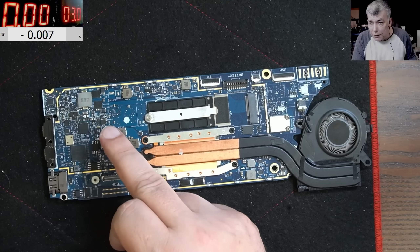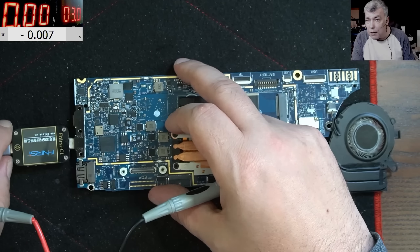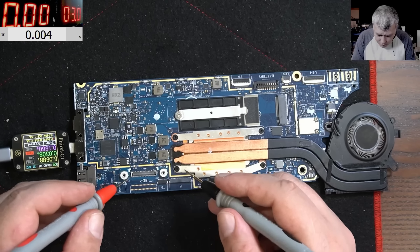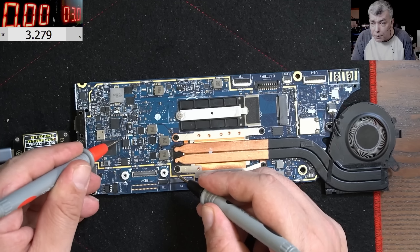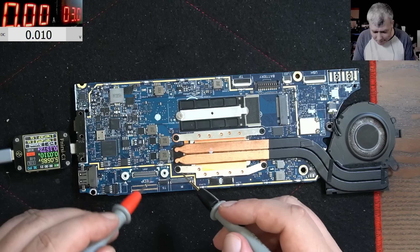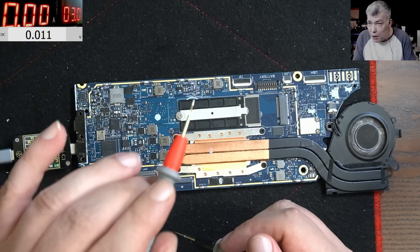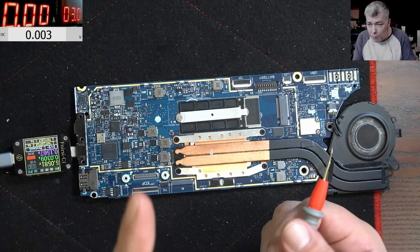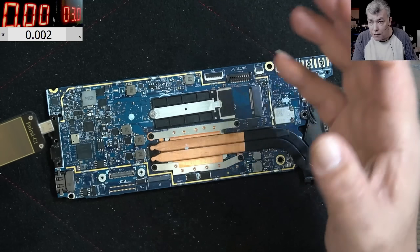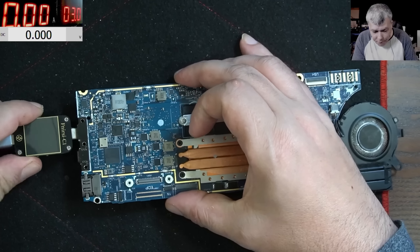Now the chip that's here is the TPS with DH at the end — this one doesn't support Thunderbolt 3. That's the reason why this chip is not working. Otherwise it's looking good: it's not taking power, not getting hot. On the memory chip I have 3.2V — the LDO voltage, which is fine. But I believe it has an issue because this TPS is speaking with the IO chip, has memory inside, and it's more complicated. That's why it's not working, but the chip is looking good.